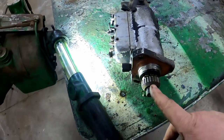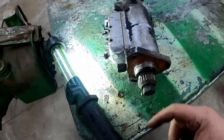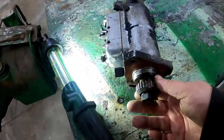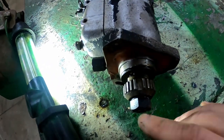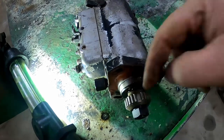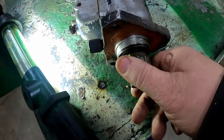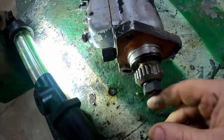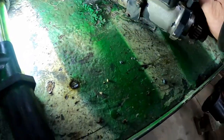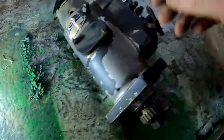As opposed to the 1851, there's a stub shaft that goes between the two. The stub shaft goes down into another gear below it and goes up into the drive of this pump. Much like this one, it's what's called a blind spline. In this case, there's a spline missing here, and on the drive hub that this sits down into there's a large tooth with no gap between it. So there's only one way this can go in — with this lined up with that large tooth. Then you just line up the hash mark, which should be on this one, but the paint's covering it.